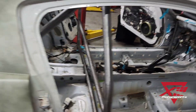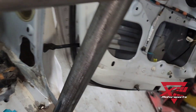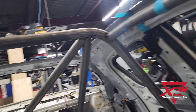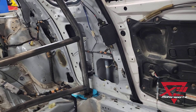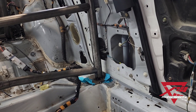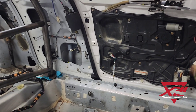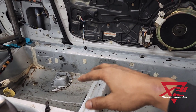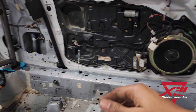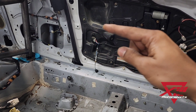I'm going to close the doors on the side here so you guys can see the roll bars a little further back. This is technically a four-door car, and the bar is very close, touching the roof panel to give us the most height. I also tried to get the hoop as close to the door as possible, but I still had to leave a little bit of room for welding so it's not completely touching the door. To do the door bars, we might end up notching out the door as it's going to be quite close to the driver. I'm probably going to work on fitting up the seat and then positioning the door bars, leaving enough room for the driver to get out. We might go with a straight bar from here to here, and then the upper bar angled out into the door panel and then come back in.